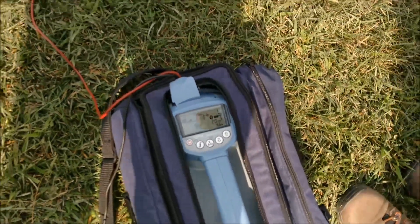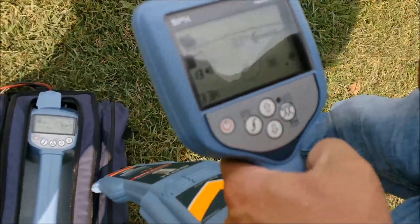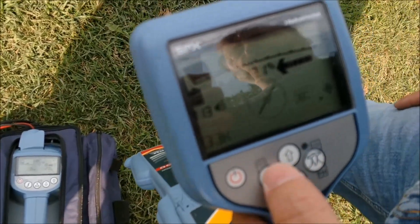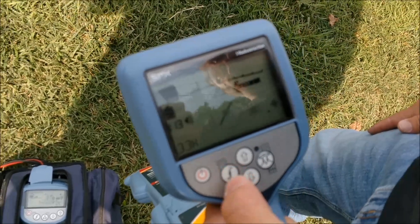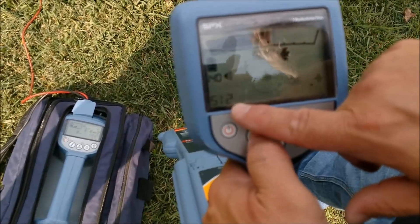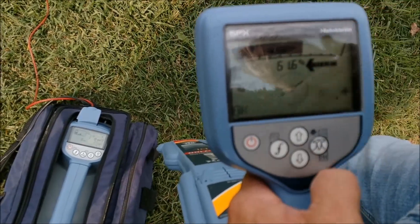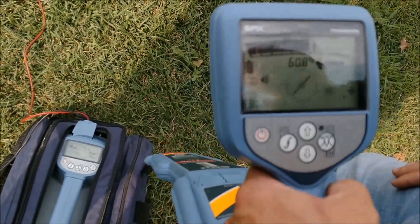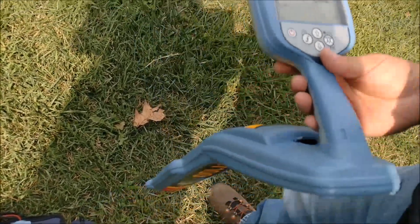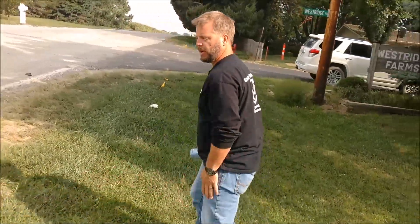With the receiver, the first thing I do is match up my frequency — turn it on and then match up my frequency. My frequencies are found on the bottom left-hand corner. I'm on 33 right now, so I'll hit the same F key for frequency to get to eight. It's just like a radio station: you have a transmitter transmitting on a channel and you've got to tune to that channel in order to pick up the broadcast. So I'm on eight kilohertz, and I will start my locate a good 10 or 20 feet away from what I'm hooked to.